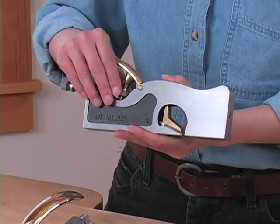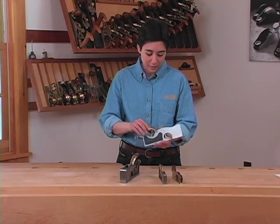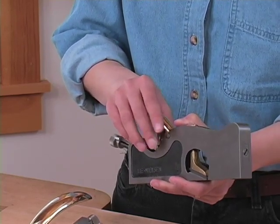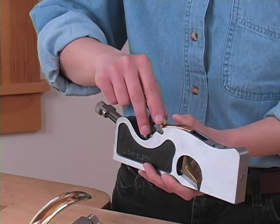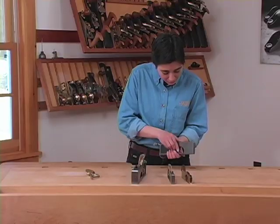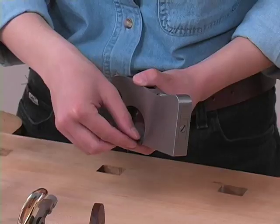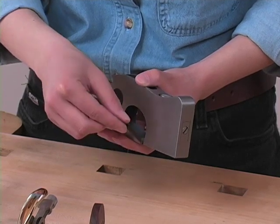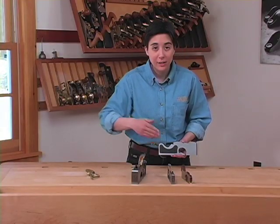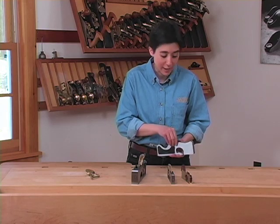Up above on the body of the plane, we have the bronze cap. Let's remove the bronze cap and take a look at what's underneath. We can do this by taking the spin wheel just below and turning it counter-clockwise as we look down on the cap. This will loosen the cap, and we can then lift it out. The blade actually extends out past the sides of the plane by just a few thousandths of an inch on either side. The blade is held bevel up. To remove the blade, we'll need to turn it 90 degrees and carefully lift it out of the plane, making sure that we don't hit the cutting edge of the blade on any part of the plane body as it's coming out.